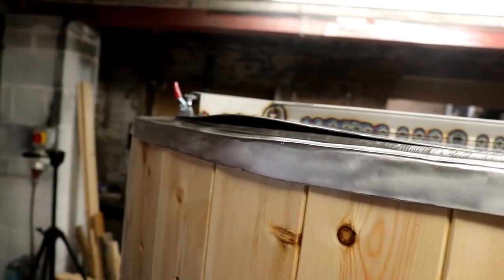Whoop. Just how do you get that out now? So I think what I'm gonna do, instead of wasting money on more steel and probably cocking that up as well, I'm gonna order some 10 mil thick Perspex, and we will have Perspex lids on the fermenters, at least. Maybe not the boil kettle because of the heat, but I think it was Perspex or polycarbonate, I'll double check what I ordered last time, but I had them on the 5-barrel fermenters and they stood up to caustic and acid, didn't etch, didn't change colour or anything like that. So I think they're going to be a good substitute for lids for the top of the fermenters, and I know for sure that they're going to remain flat.